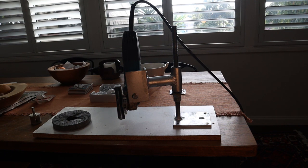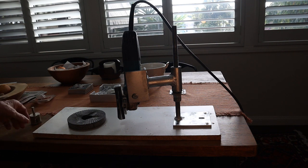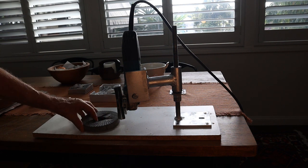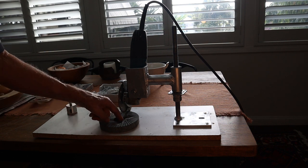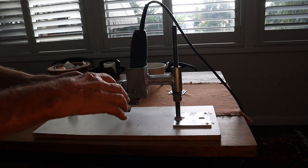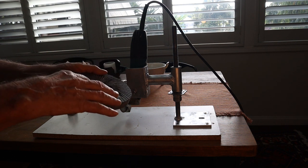After you've cut out your stone, you have to drill a hole in the middle using a diamond hole saw — use a lot of water with it. And then what you do is mount it on the timber using a wooden dowel so that it rotates around the dowel. And when you're finished, you have to cut some notches in here — you need a little bit of room for the grain to sit.